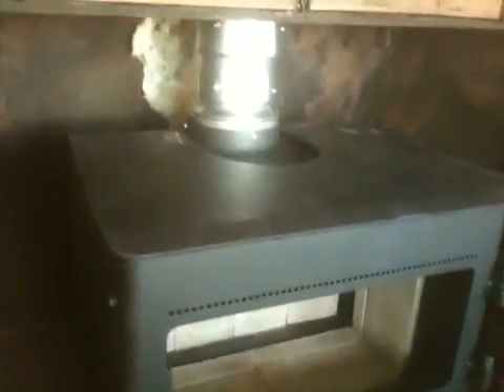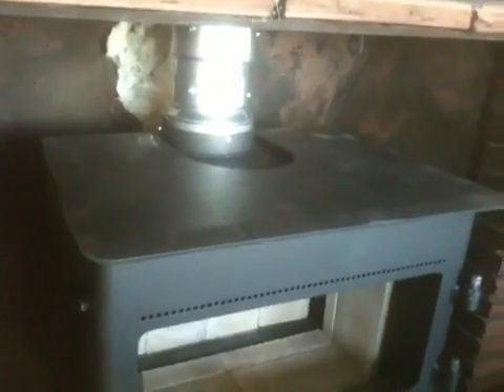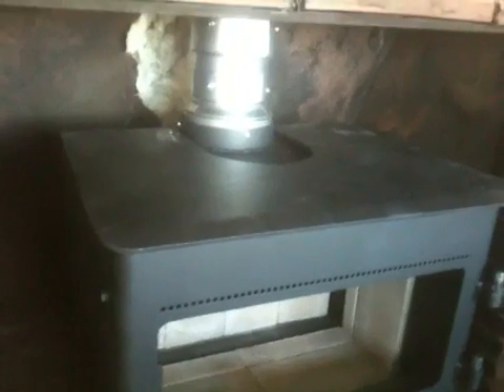We're just putting the shield on here. This particular offset is a Regency unique thing — you attach everything like that, then you just slide the insert in, slide that piece into the insert, and bolt it in from inside the firebox. There are a couple of bolts up in there, and it becomes part of the firebox, but it gives a little extra space to make that flex flue stand up straight and make a nice installation. This is the small Regency, and we'll be putting the faceplate on here in a second, so we'll show you how to do that too.